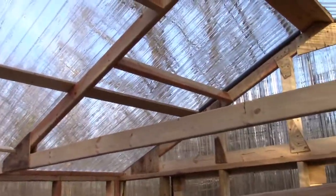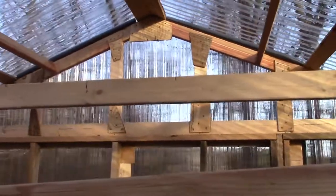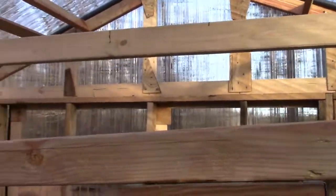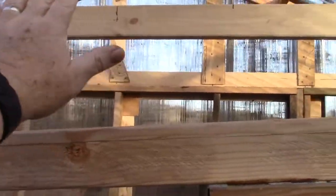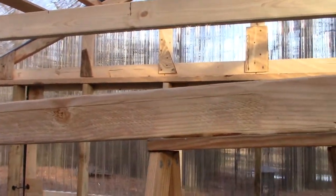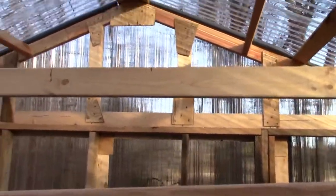Time to build the mount for the heaters. I need four feet of vent, and the distance between the end wall and the first rafter beam here is four feet, so I need to mount the heater right in here. To do that I'm going to screw the heater into some boards, but the rafter boards are too low so I need a board that's higher.